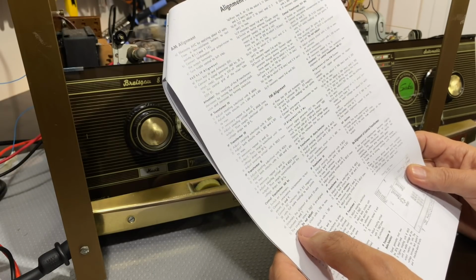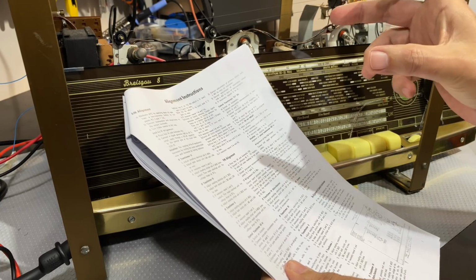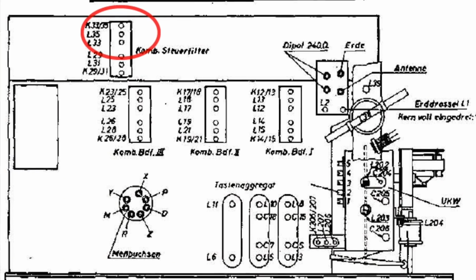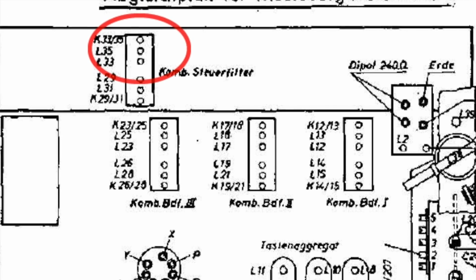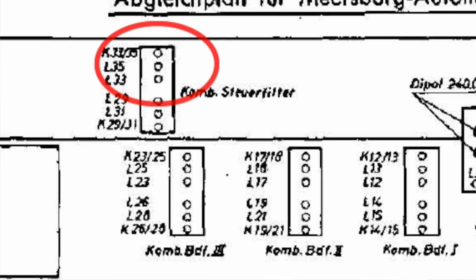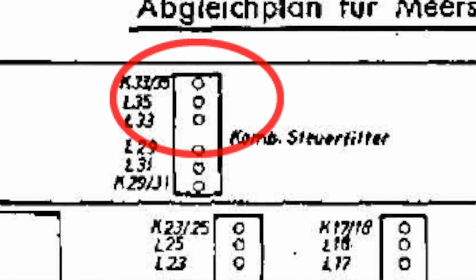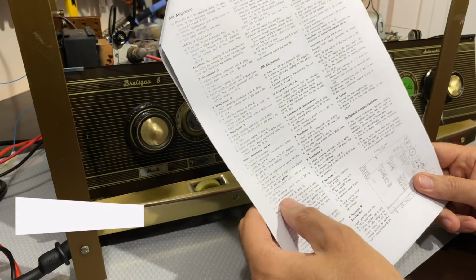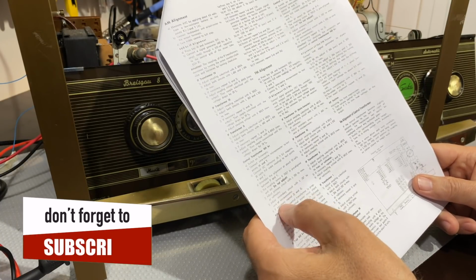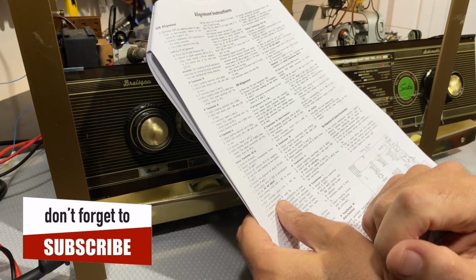And then they tell us that the coupling screw, now we are aligning that IF transformer at the back, the one that comes out the back, which again, I'll show you when I'm doing it, the coupling screw between the two is preset, so do not adjust. And I will not be adjusting that. And then you adjust the primary circuit to maximum on the voltmeter, and then you adjust the secondary with the other coil to 0 at the microammeter. Now I presume this is similar to the FM alignment, the discriminator alignment.